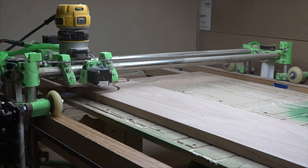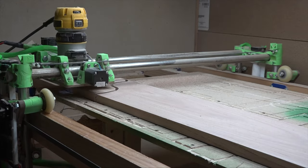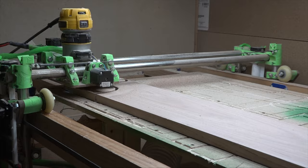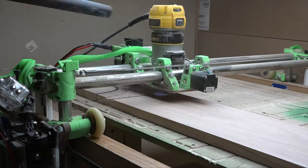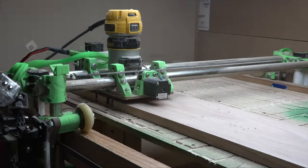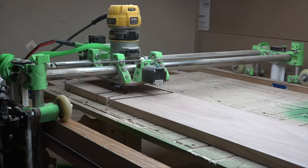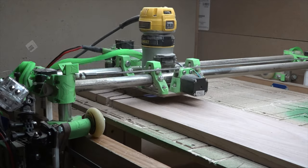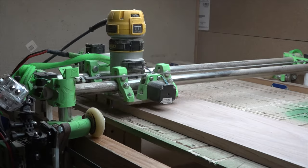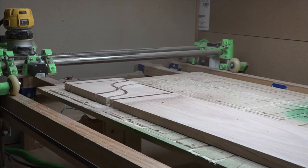It's just not going to hold the plate, so I said I'll just build the shelf. I went out and got some three-quarter by eight-inch oak, and I bought one piece that was eight feet long — that's going to be the length of the shelf. I mitered the corners a little bit, rounded stuff over, and on the top I had a couple of grooves with a handheld router.